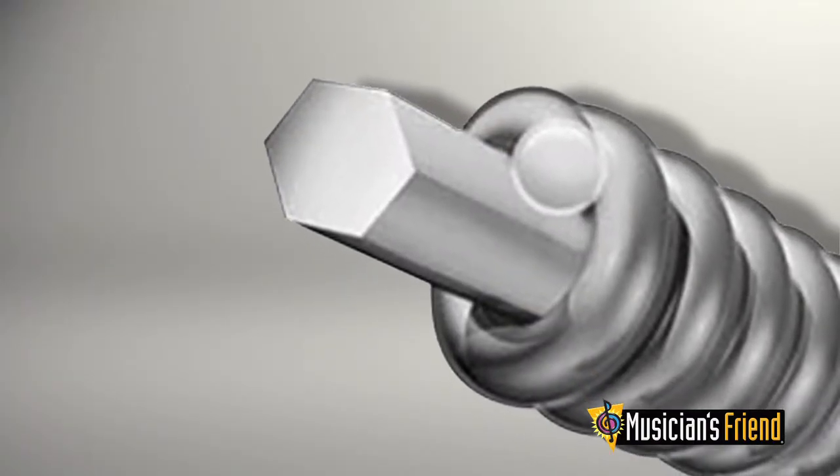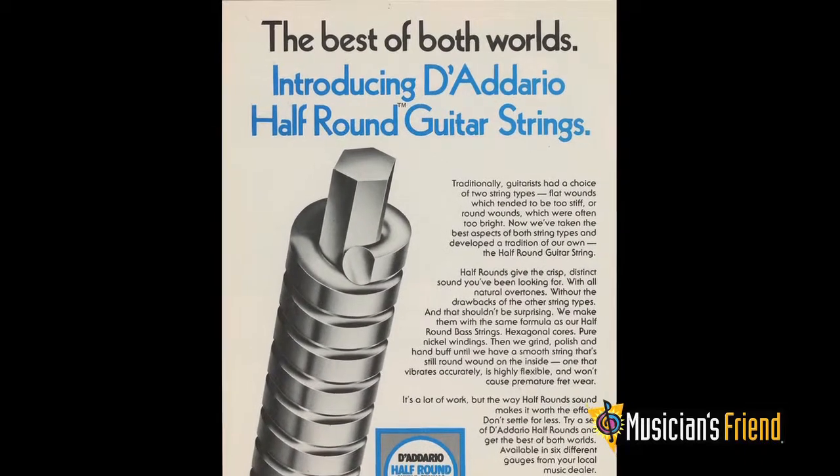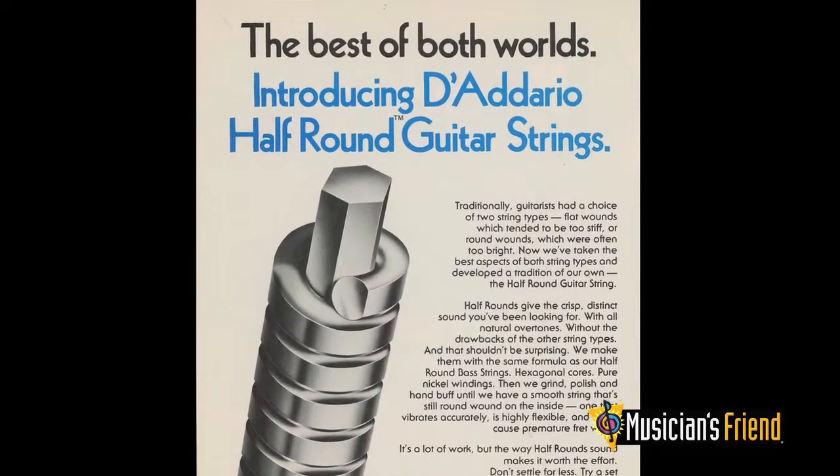The idea of the hex wire is that if you looked at a cross-section of the wire, it's got six points and six flats. So when the softer wrap wire goes around it, it bites into that core. Making hex wire is very difficult because somebody has to make a die out of tungsten carbide and make that perfect hex shape. We've got digital laser inspection on these machines now that shows us the peaks and valleys, the flats and the points — and we are holding a hex shape now that's like nothing you've ever seen before.